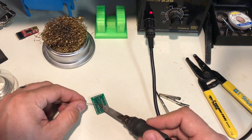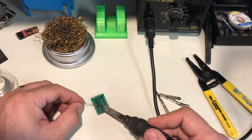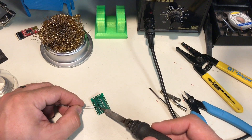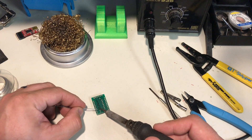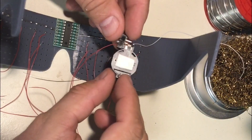I pulled the chip out of the socket and soldered it to the board. Once I did this I really couldn't program it again easily. I still have the programming pins at the top row of the board, but I'm going to cut that off so it'll fit on the bridge of the glasses — and that's what I did.